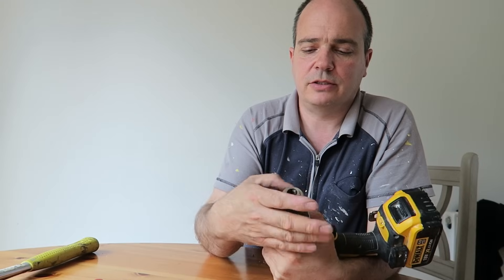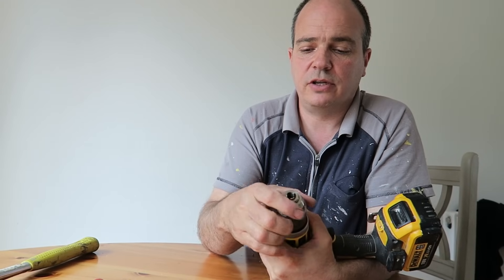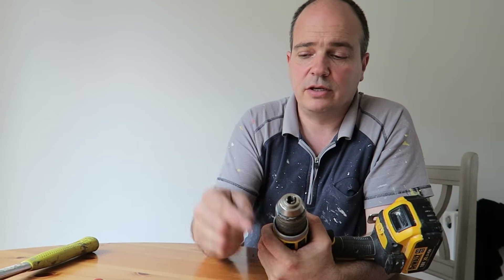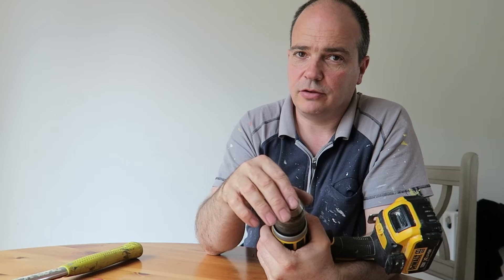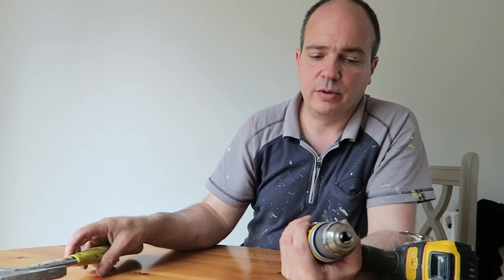The grip's in there. Once that's done, it seems to free up — give it plenty of oil and you should be fine. Remember, do not whack it hard. You're just tapping — a gentle tap. Nothing more. Don't be bashing it at full force. You will break the chuck.